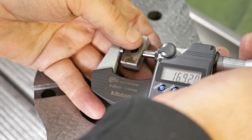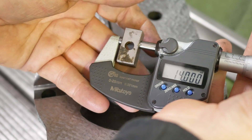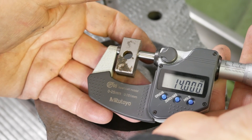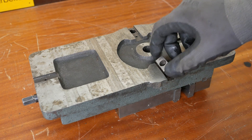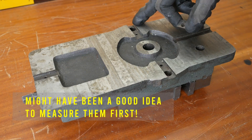This mill's got 14mm T-slots. The keys which Luke gave me are spot on. These slots are going to need to be widened slightly and the holes drilled and tapped. I also need to check the alignment because it may well be that the slots currently don't align properly.